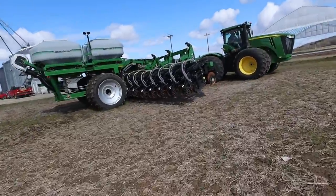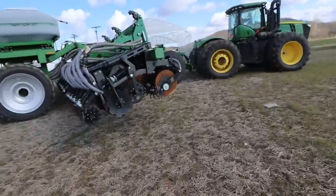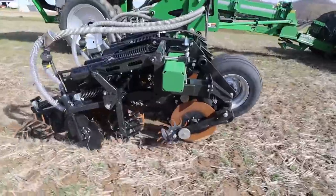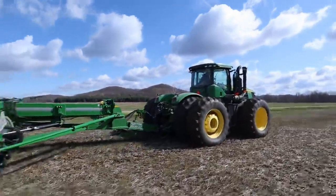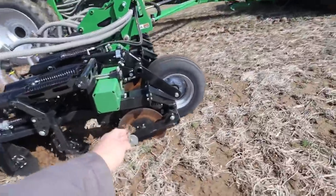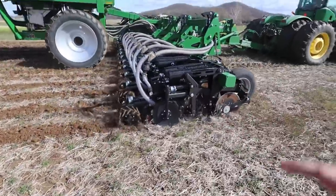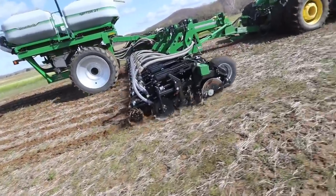Chris is in the tractor and we're going to walk beside to look at the units. I really don't know if we'll have enough power for this - I haven't tuned this tractor yet - but we'll see. He's going to blow just a very small amount of fertilizer through the system to make sure everything is working. We're pulling it now. You can see this disc up here is just slicing the ground, our row cleaners are moving trash out of the way, and here's the fertilizer coming through. The gauge wheel is basically just floating - that's what's controlling the depth of the unit. It works a lot like a planter depth wheel, floating up and down to follow contours, so we're getting that fertilizer at the depth we want every time.